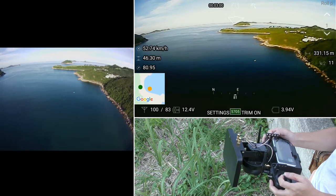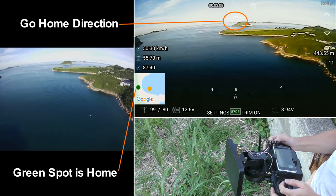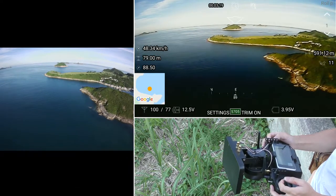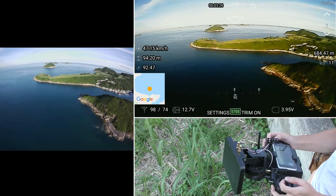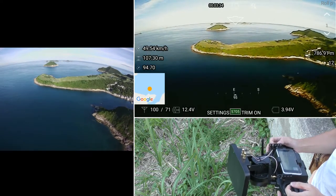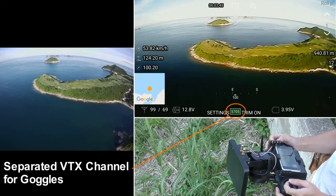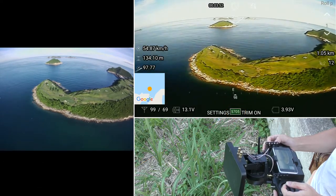It takes some time to arrive at the remote island, so let me introduce some features of the ground station system. By knowing the real-time GPS location of your aircraft as well as your phone's location and orientation, it shows you the direction to fly back home. It also points the high-gain patch antenna towards the aircraft so it can fly far away in manual mode with low power while still getting telemetry data. This is critical to keep your drone light-weight and simple. It records your flight path with all telemetry data, and at the bottom center of the screen you can see the video channel frequency in use and change it anytime during the flight. There is also a separated low-power 5.8GHz video transmitter inside the ASTRAF ground station for short-distance video transmission between the ground station and your FPV goggles.